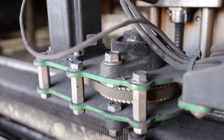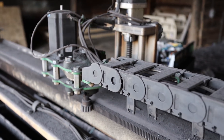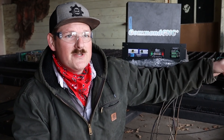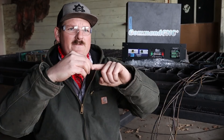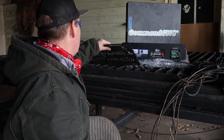In the beginning when I first built the table, everything was really tight, but there was stuff I didn't understand - like weight, torque, and motor speed - that basically ended up tearing apart these gear reduction units on the side. These are 3.5-to-1 gear reduction units and they're really designed for a lighter gantry. I went six feet wide on this thing because I thought I was going to add a tube cutting section. Its weakness was that the gantry is too heavy because I made the table too wide - it's got a really solid 3x3 steel tube across the top. The weight of the gantry changing directions really fast was causing those set screws where the motor turns to slowly slip.